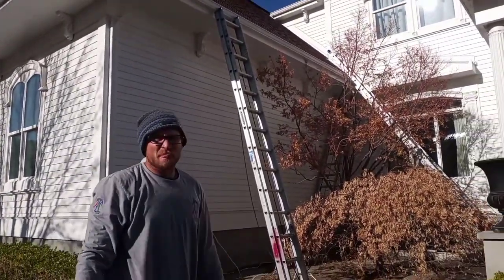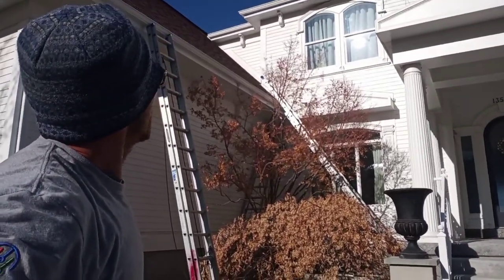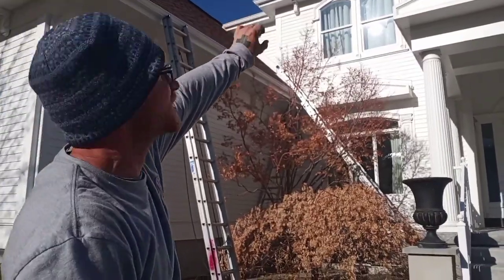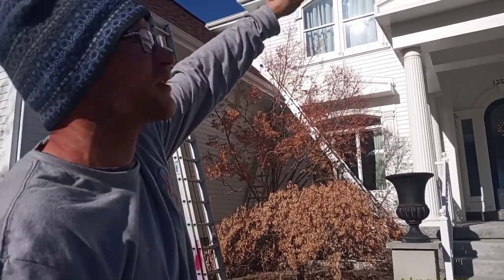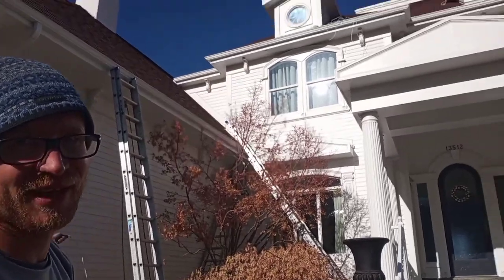All right, cool. Hey, I noticed up there that you only have a wire coming out the two insides of those dormers. That's because we still have to run a wire up to it. There was no attic access for me to get a home run to the left side of the dormer. So I was able to do the jumps internally from one side to the other, but we still have to run our line up. You have to do an external to the left side of that first dormer, I see.